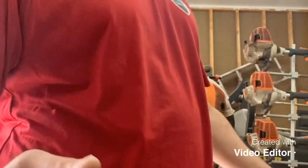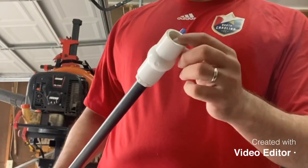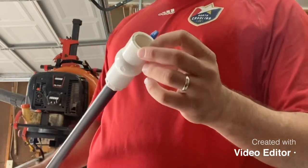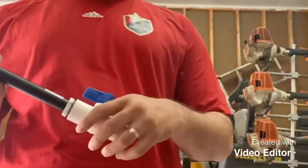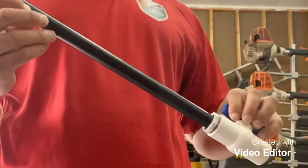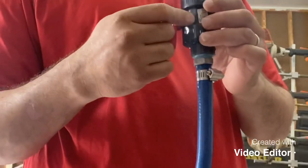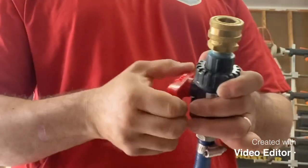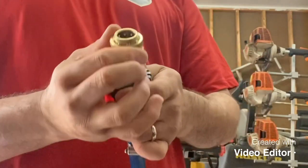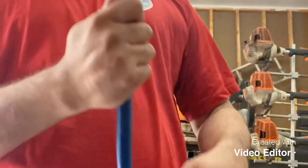Hey guys, welcome back. I was already able to put everything together. Like I showed you earlier, this was my gun for my soft wash system before — I had a three-quarter to half-inch straight to the hose, which I couldn't take in and out; it was always dragging on the floor. So I was able to make this improvement. I put a schedule 80 ball valve here — chemical resistant — just on and off. Half-inch quick connect straight to the hose with a half-inch male to the hose straight, as you can see right there.